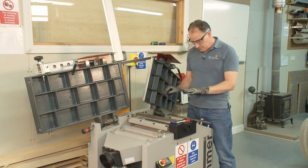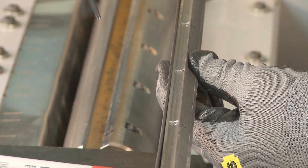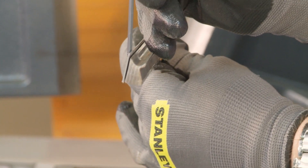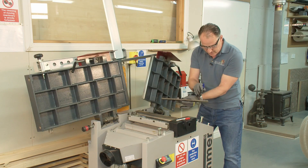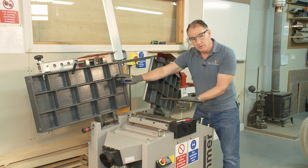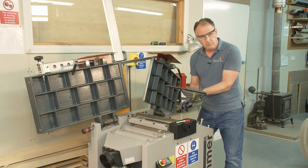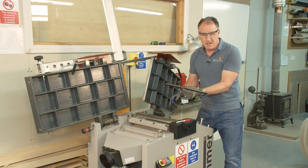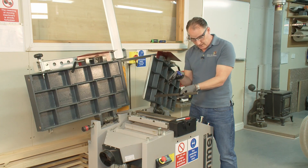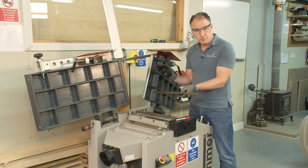If for some reason one of these blades was lower than the other two in the block, we can make an adjustment. In the wedge bar there are some smaller grub screws — the allen key goes in there, and as I wind that grub screw out it pushes the wedge bar up and therefore pushes the cutter up, so we can adjust the cutters up or down. These are basically factory set and there should be no need to reset them generally — I'd only reset them if you had to reset your outfeed table on a surface planer or you had an issue with a thickness planer and the bed had moved. If the bed had moved, first I'd check nothing has come loose, but if it's getting worn you'd need to readjust the wedge bar and cutter to suit your table, doing test cuts and measuring the timber output size to adjust the screws accordingly.